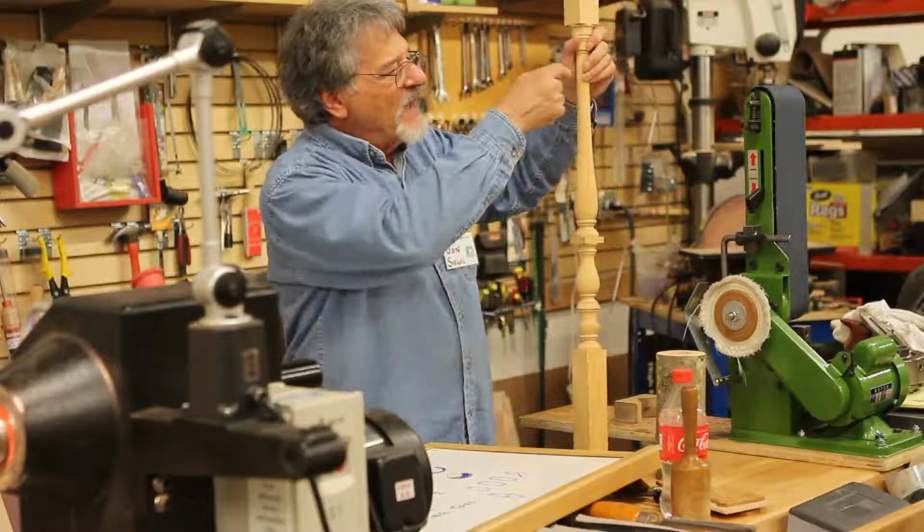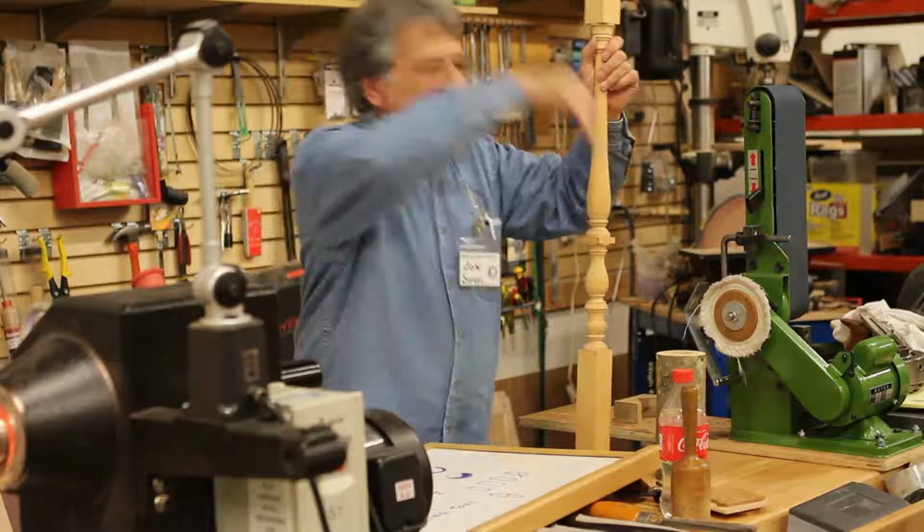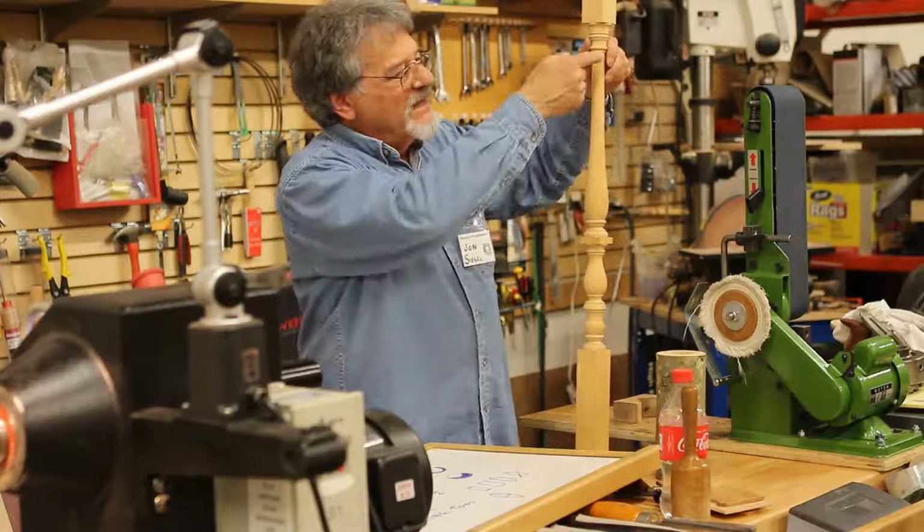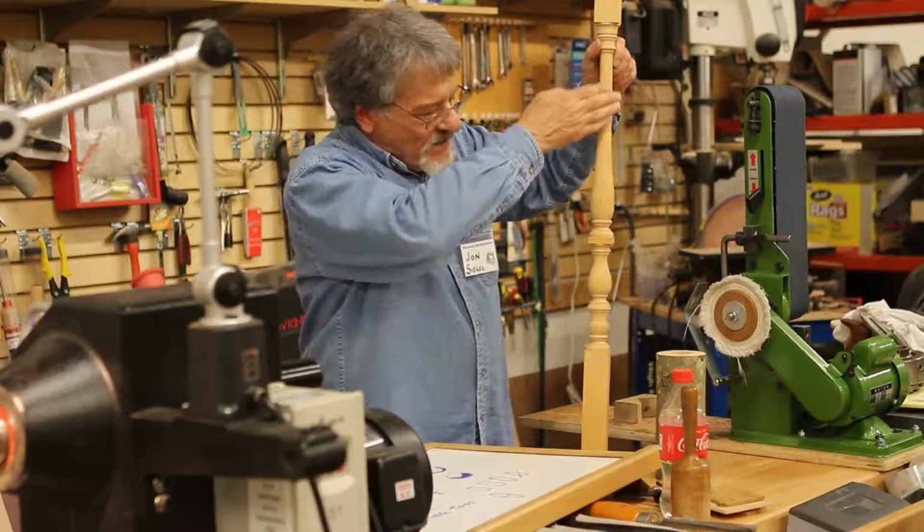once you've got those cuts in there, you're trying now to smooth that out. Every time the chisel hits one of those cuts, it crashes down into that. And it's much harder to get the smooth line when you've got those interruptions in the line. Now what you really want to do to make this line is to start here, and as you get deeper, you're continuously creating the shape until you get to the very last cut, and all you're doing is smoothing it out.